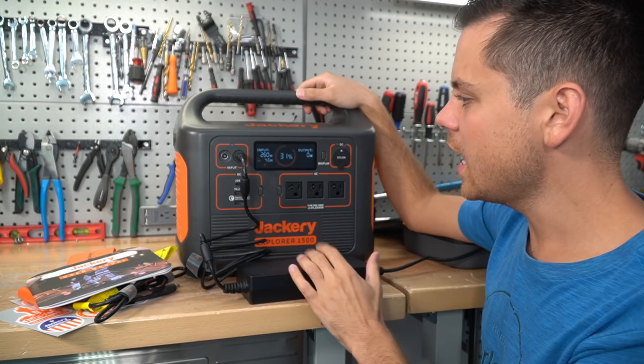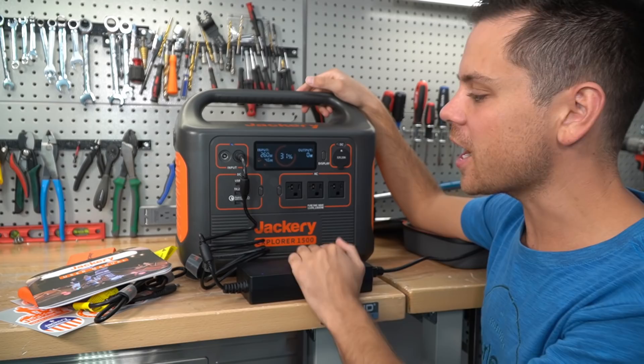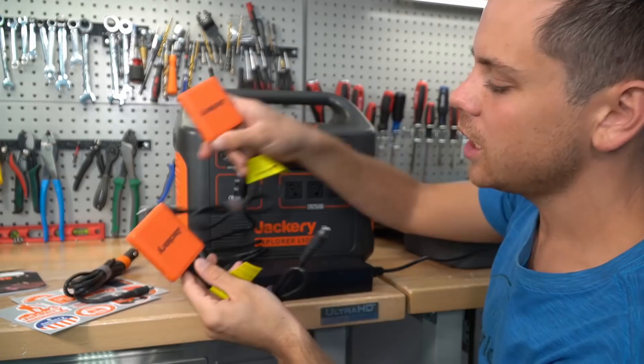This AC charger is a huge disappointment. I've tried both inputs and the best I can get is 261 watts, not 500 watts, so I'm not going to test this any further. I hope Jackery can improve this — add lithium iron phosphate, fix the input, and notice what other competitors are doing. Using these little adapters with that high of a current is unnecessary, and you also need an MC4 adapter — everybody else on the market has one except you. Please let me know what you think in the comments. I'll see you in the next video.